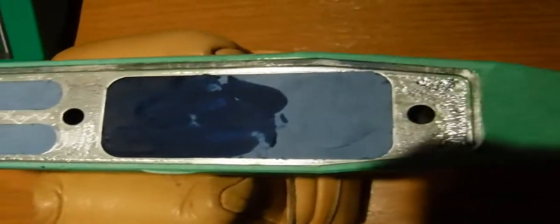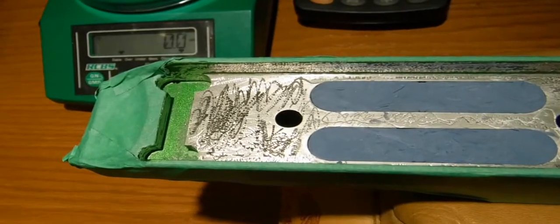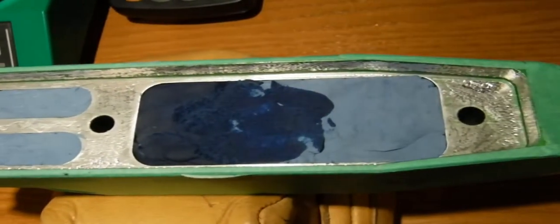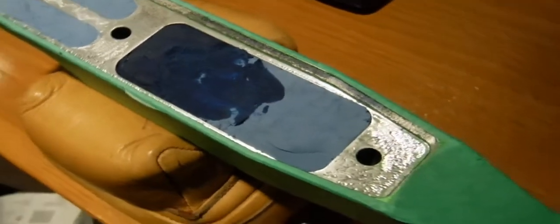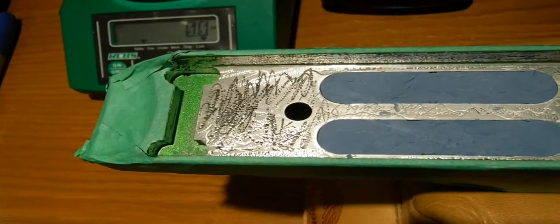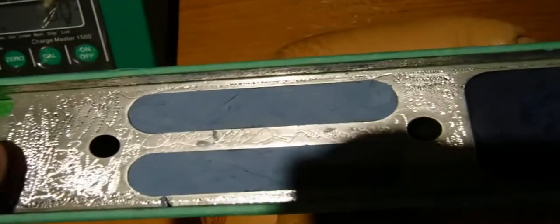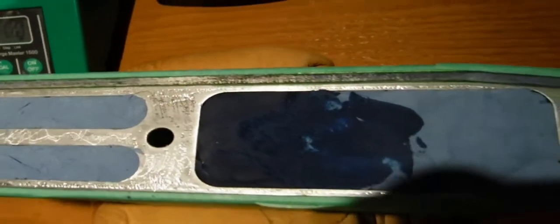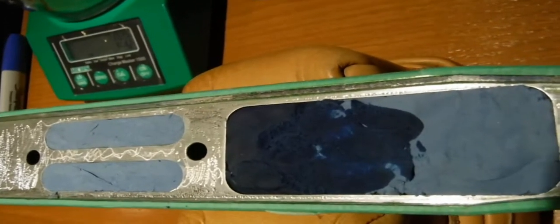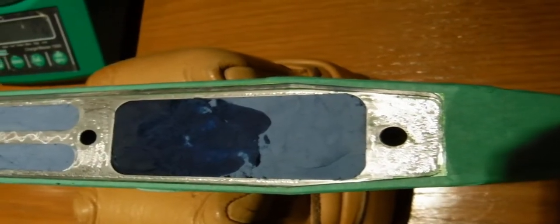The surface is all roughed up and I'm going to clean it up a little bit with some brake clean or something similar. This is about an hour's worth of removing the paint and trying to get the recoil surface roughed up in and around the bedding area. The paint was very uneven — some very thin spots and some very thicker spots towards the recoil lug. So I'm happy that I'm doing this.